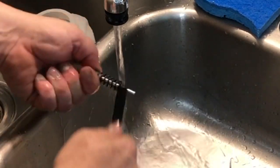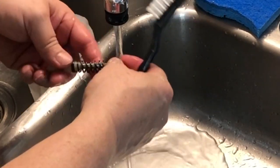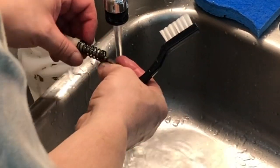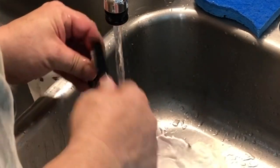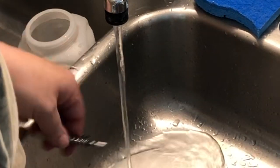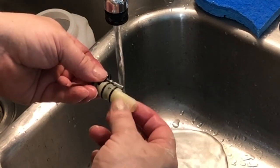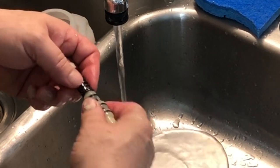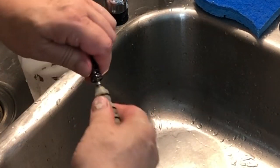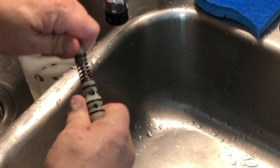And this over here, take that and get inside there where that spring's at for that piston. Make sure you get all the paint out of there. And when you get done, it's totally up to you, but you probably need to go ahead and put some oil on this thing right here. The way this goes back together is, you got the screw in right there. Well, this goes on this end, and just make sure that spring pops over the end right there. So it just comes apart like that. And when you pull the trigger, this opens up and lets paint come through.